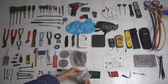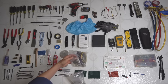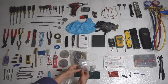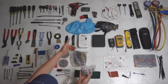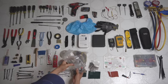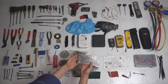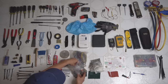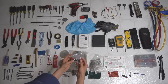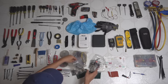I also accumulated over a couple of years a big ziplock bag with more bags inside. One has rubber bands and wire holders. Another has spare drill bits for when I lose the ones in my magnetic tray. Then a spare bag of screws — various screws, various lengths — another bag of screws, a bag of washers, and a bag of rubber and plastic caps. Sometimes inducer motors or collector boxes in furnaces are missing them — these are nice to have and you can just plop one right on.